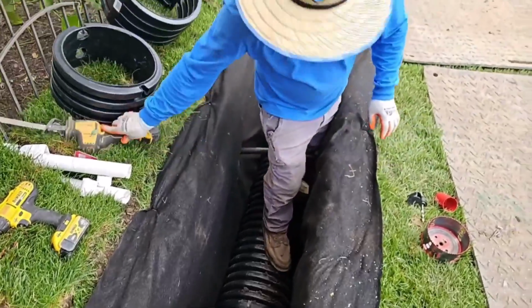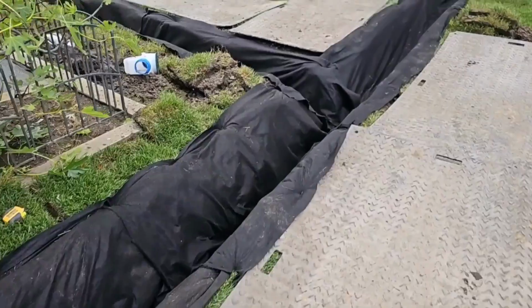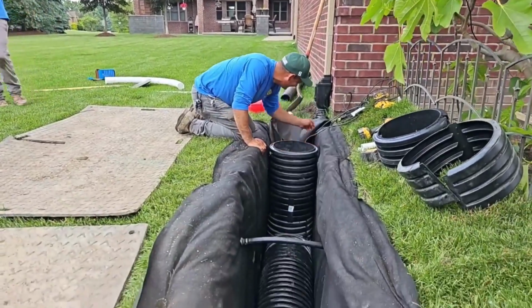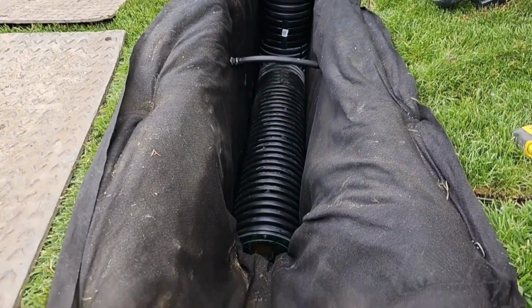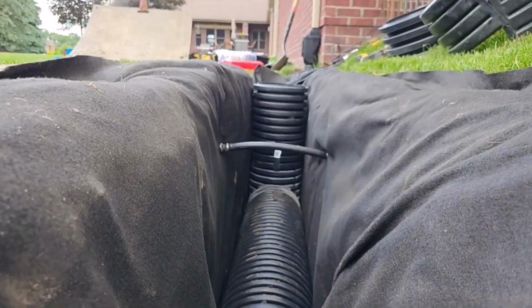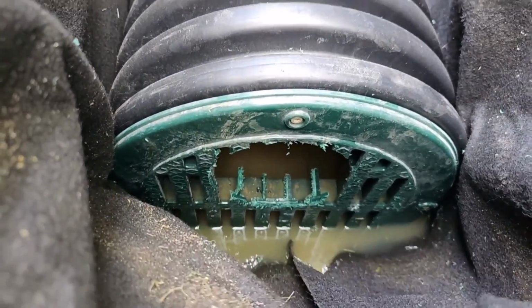It's best to just pipe this right in. If you got downspouts, or if you have a catch basin on a solid pipe, tie them right into your outdoor sump pump basin. Now look at that 7 feet of chamber we have on that. And this is important. Look at how we drop.